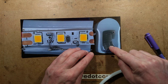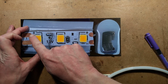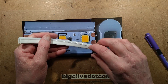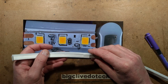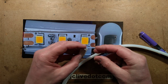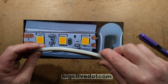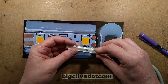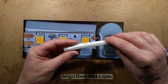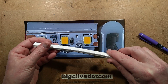This channel has the LEDs running along it and they've got a continuous strip tapping on at regular points. I initially thought it would tap on for every single inch, but it's kind of hit and miss — you're very unlikely to use a single inch. The connections are actually every 50 millimeters. You can see a slight ripple on the side of the plastic — those are the connections into the inner circuit board arrangement.